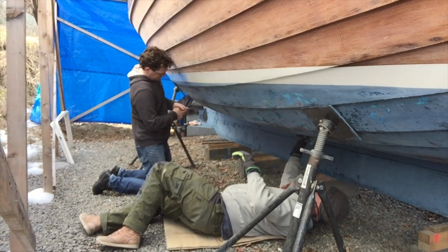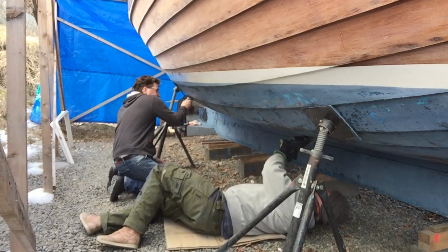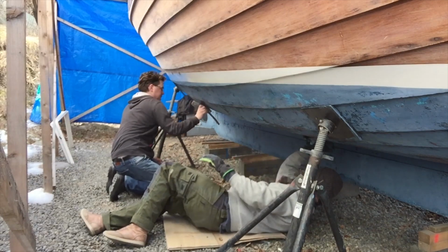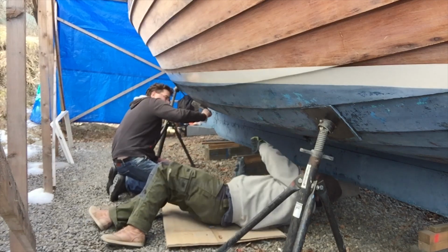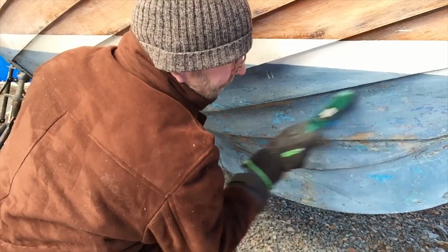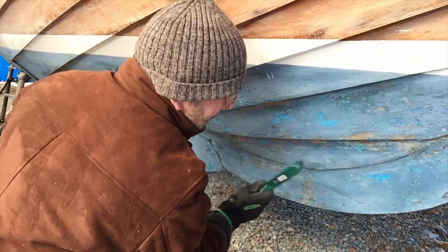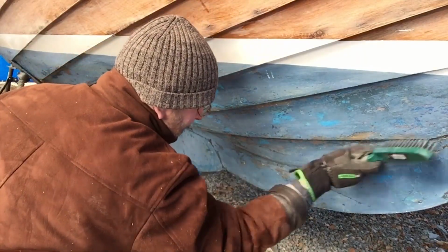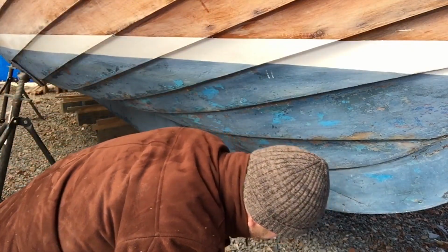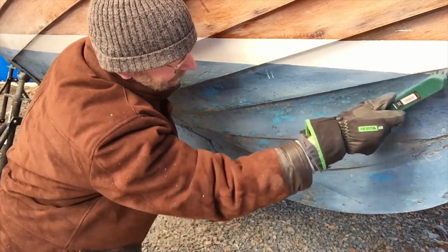The lower end of the hull, below the waterline, is painted with a special thick paint called bottom paint. When the boat is lying in the sea, creatures like mollusks and different kinds of seaweed want to attach themselves to the bottom of the boat. So the bottom paint peels itself during the summer season, which makes it harder for sea creatures to attach themselves. We used wire brushes to scrape the bottom clean, to make sure no loose paint or any mollusks were still attached under the boat before we started to paint.